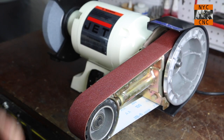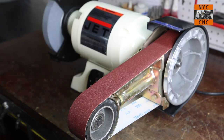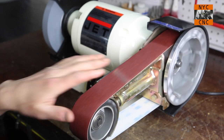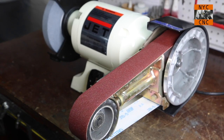I also normally do not grind on my workbench — I grind in the garage where I have all my messy stuff, but I moved over here just for making the video. This is going to throw off a lot of nasty grime, so don't grind next to nice equipment normally. Also, normal cautions — this is an incredibly fast moving belt, I don't know how many thousands of feet per minute, so be careful with your hands. Remember it's sticking out 12 inches versus a regular bench grinder, so you've got to be careful.